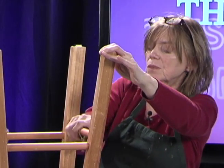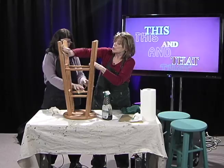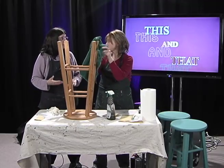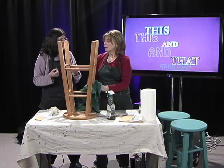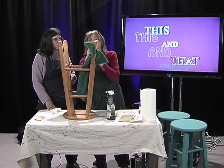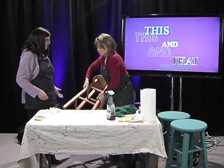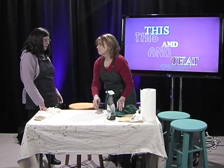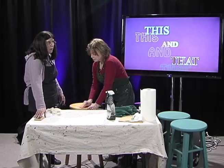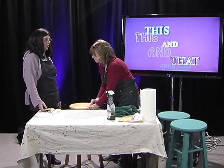The paint that we're using — we're not going to prime. It's all the rage. There are multiple kinds of chalk paint out there and we're using chalk paint. Chalk paint is chalk-based. The paint we're using today was imported from England — it is kind of pricey. There are other ones made in the United States that don't have import charges, so you can look for those. You could also use 100% acrylic paint — any paint that is 100% acrylic should stick. Not latex — acrylic.